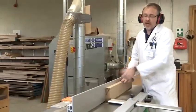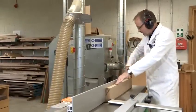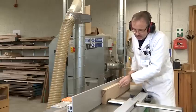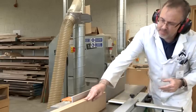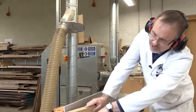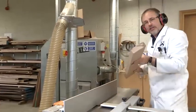Always be aware of where your fingers are when you're using a machine like this. Keep them well away, at the top. But keep your piece of wood against the fence. The pressure I'm putting is on the outside table. If you look at how this is here, you can still see that's not flat — because there's a gap at that end but there isn't at this end. So we've got a little bit to do still.